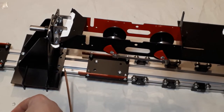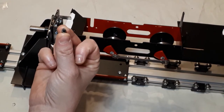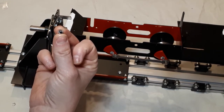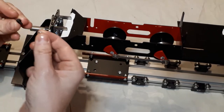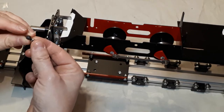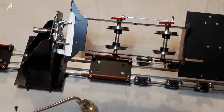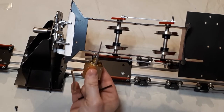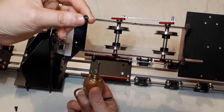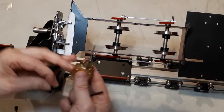Make sure that the washer fits between the head of the socket screw and the frame. The copper exhaust pipe should be bent forwards and slightly up out of the way. So it's going to go on there like that. So now I've got my block the right way and the washer on the screw. You also need the Allen key that comes in the set.